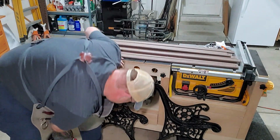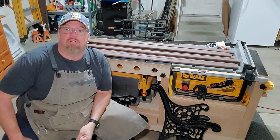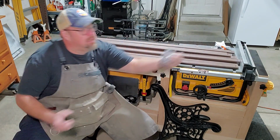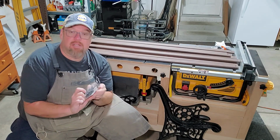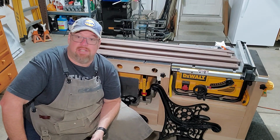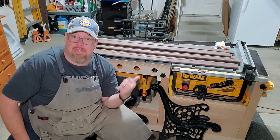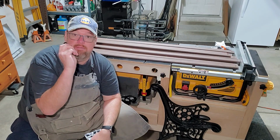You can buy these at your local hardware store. Already powder coated black. But you won't find them in the hardware section. Where you find them is out in the fencing department. And these little guys, you buy a bag of them. These are used for putting chain link fences together, especially black chain link fences. And they're already powder coated. And they're the exact right size to go into this bench. So that's what I'm going to use, these black powder coated carriage bolts.